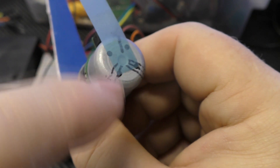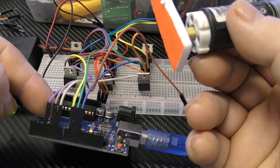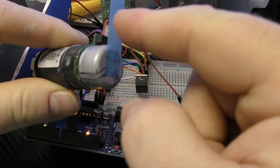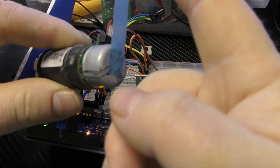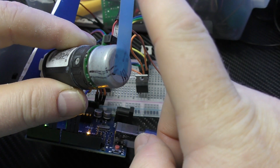If you can imagine a tripod under the magnet here — this is a round magnet — I've got a three-phase H-bridge set up here, being driven by an Arduino, and I'm using pulse width modulation to generate AC sine waves. I'm generating an AC wave on each of the three coils so that it alternates. This one might be at full voltage, while this one is only at, say, a third voltage. Then I swing it so that this one drops to zero volts while this one, at the same time, goes to maximum voltage, so it pulls the magnet around.